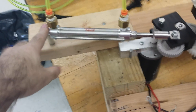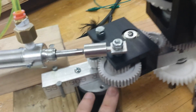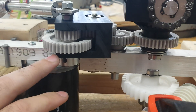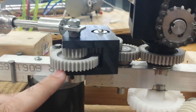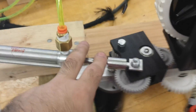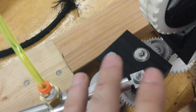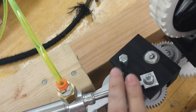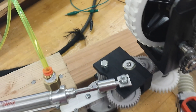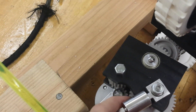I did pretty much just eyeball the orientation with this, but it's not that critical. Now, as you can see, there was a slight modification on our block — instead of just two plates, I actually took a block of acetal and machined it out. This stuff is actually quite rigid, at least for this application. One of the biggest concerns people had was using the piston — when we engage it, it'll actually cause the gears to bind up. Before I made a recent modification, that was indeed the case. The more pressure we put, the more it binded up, and it was bogging it down quite a lot.